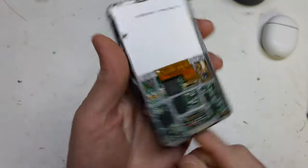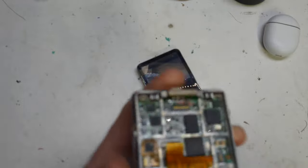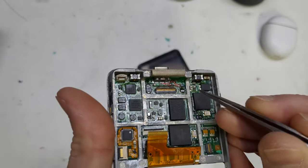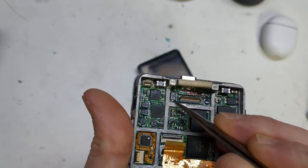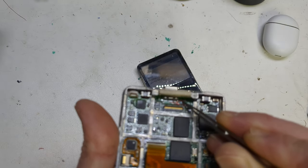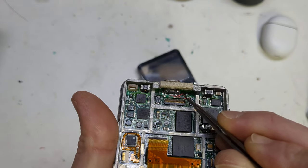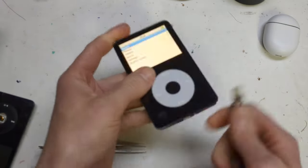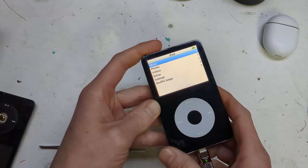The USB-C port — the way it works — there's this little thing for the USB. You basically tap into that for your plus or minus. Your ground is attached to this capacitor here. And then your power is on the 8th pin from the right, as you look at it this way — that is your power line. And then that's it. You can use your USB-C cable here and juice it in. You can see it charging, although it charges extremely slowly.